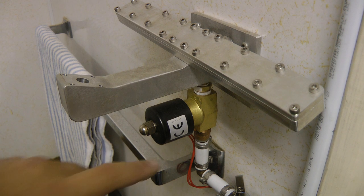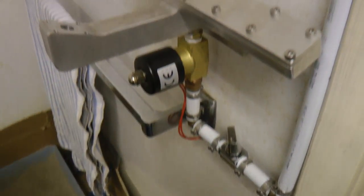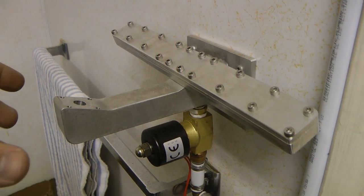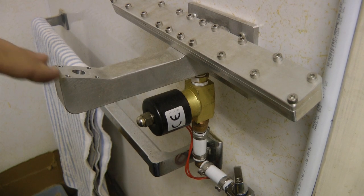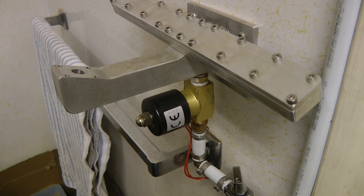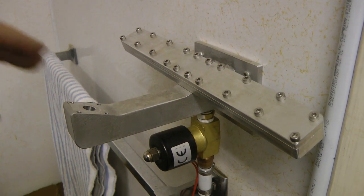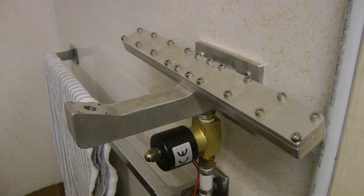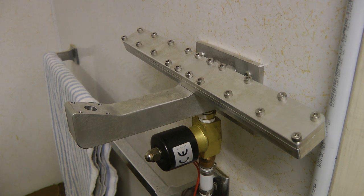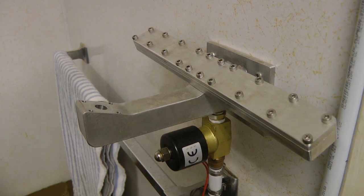One of the biggest problems I had on this project was actually finding a proper valve for this. Initially I tried to find a foot valve because this is currently controlled by a foot pedal on the ground. But I couldn't find any reasonably priced foot valves that had a wide enough air opening to actually run this thing. I ordered a few different ones from eBay but none of them allowed enough air through. This takes quite a vast amount of air — just a quick estimation, something like 40 SCFM, equivalent to four pneumatic impact guns basically running simultaneously, so it does drain the tank very fast. Luckily it doesn't take too long to actually dry your hands, so it's not a major problem.